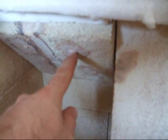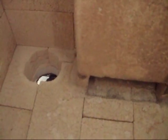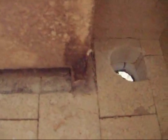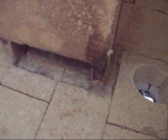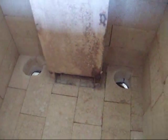That cement was kind of deep — it must have been dry — so it actually swelled up a bit, but it's hard now so I'm not worried about it. Down at the bottom on both ends of that chimney — you can see it better on this end — there's refractory cement packed in the front. There was about a half-inch space so I packed cement in the front to lock that chimney box against the back, and on the sides as well. Everything is pretty much solid. The bricks are still nice and warm this morning but not hot.